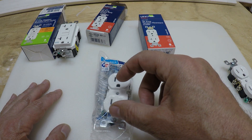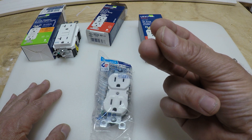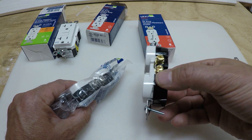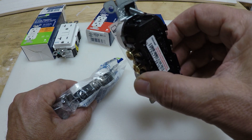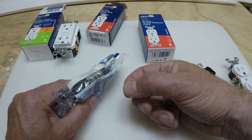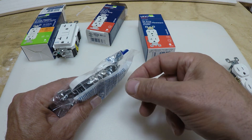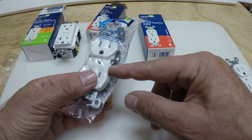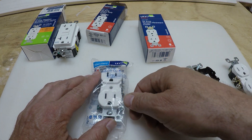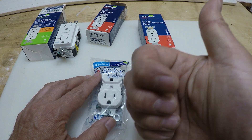One of the main issues with aluminum wiring is that when you get heat buildup, aluminum wire expands and contracts much more than copper wire, and that loosens the connection. It can also oxidize when touching a brass or copper connection. That oxidation creates a gap in the electrical current and builds up heat, which can cause a fire — it can melt the wire nuts or even melt the outlet. I've seen that happen and I've had that situation in my own house. I have another video on how to deal with aluminum wiring and making secure connections.